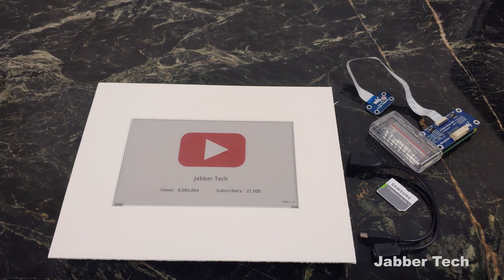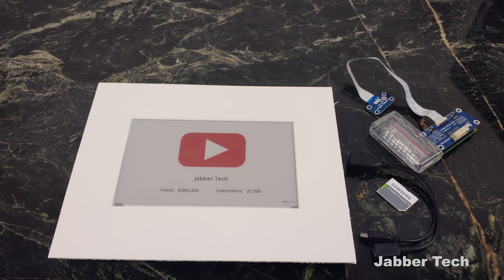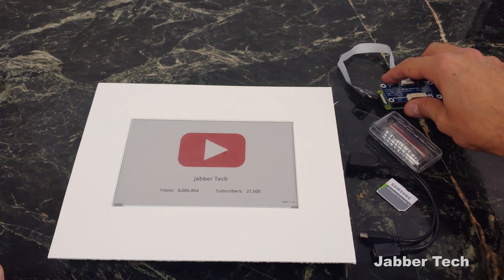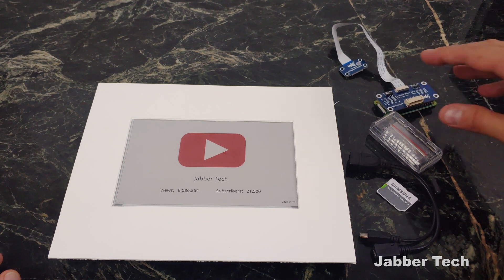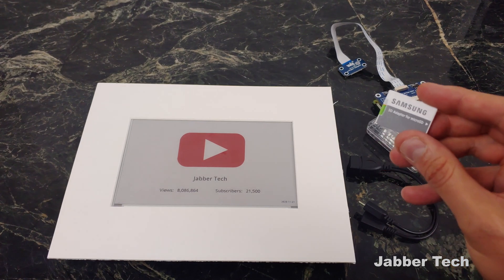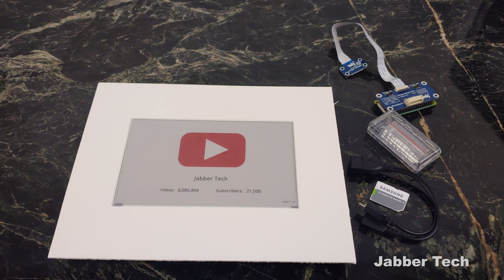I'll link all of the items I used down in my description below. To set this up, I would say it's on the easier side — it really is copy-paste. Again, thanks to Michael Clements who put together a step-by-step tutorial. For this project you will need a Waveshare e-ink 7.5 inch display with a Pi hat for your Raspberry Pi. I chose to use the Pi Zero because it is a cheap option and you don't really need a lot of power to run an e-ink display. It's only going to refresh a couple times a day. You will also need a case and a micro SD card — I'd recommend at least 16 gigabytes, but if you have something laying around that should probably work as well.